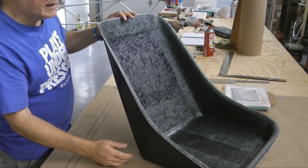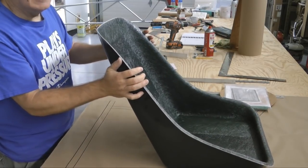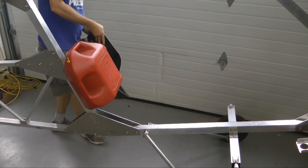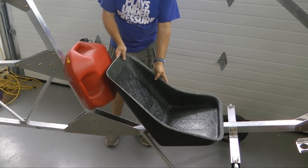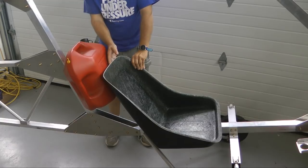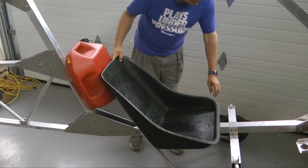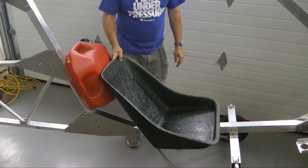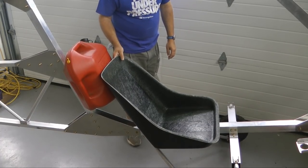So let's go see how this fits onto the airframe. Remember, a fuel tank will be behind, so that will be the limiting factor as far as how far back it can go. I'm going to leave the gas tank in place because that's going to affect how this fits. I'm simply going to put this right on the tube, centered, and I will leave a few inches in between in case we get a different tank or in case we need to remove it. So a few inches there at the back, up at the front, that leaves approximately 2½ to 3 inches from the back edge of the cross tube. And with this sitting flat, it looks about a good location for it.